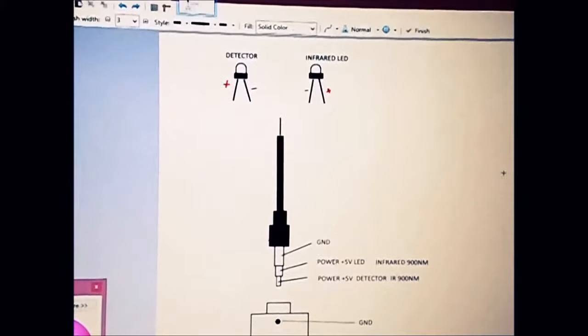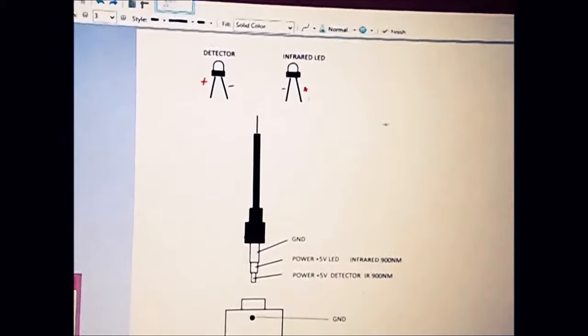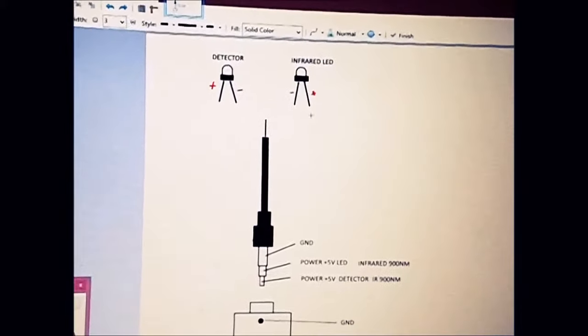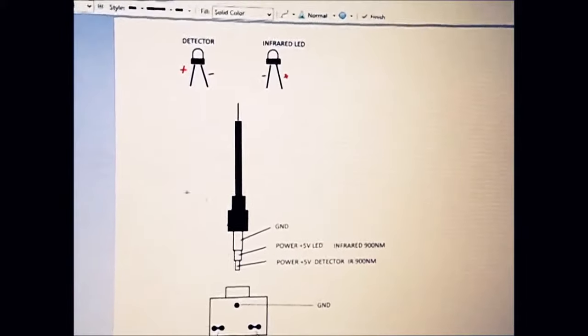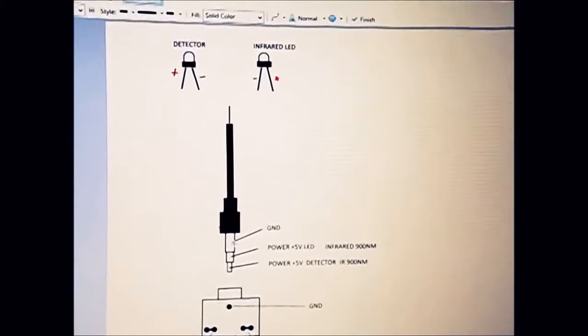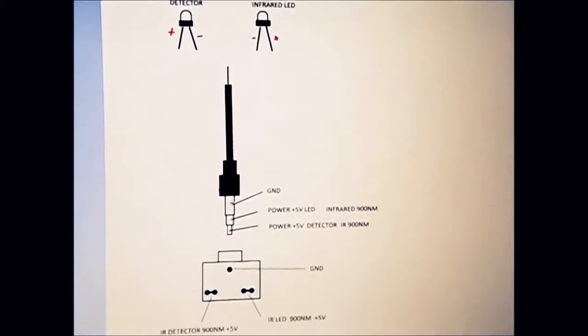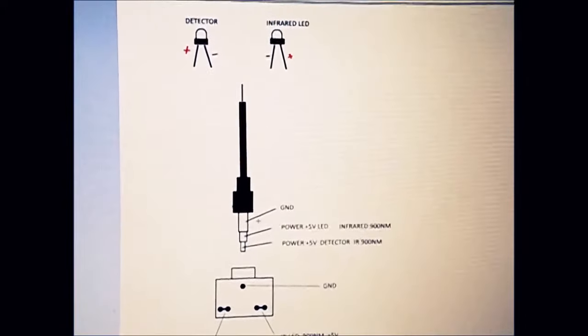In making the cable, first off, we need to know that we need to connect three wires, even if we have four connections, and for that we will use an audio cable, which has a ground connected to this bit there, which is the first ring.